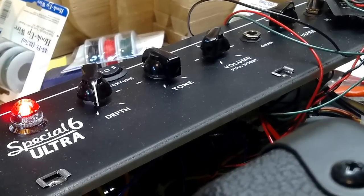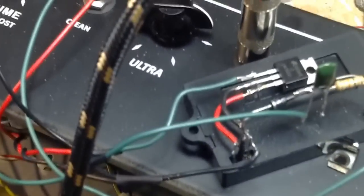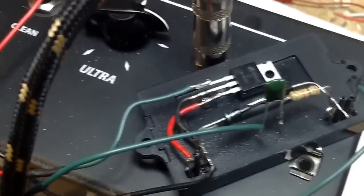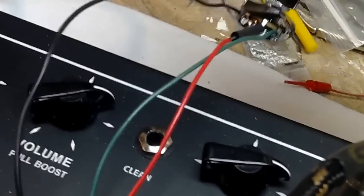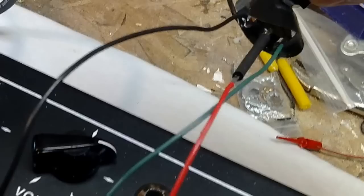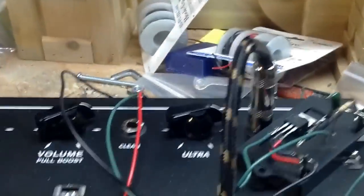Anyhow, very nice — really pleased with it. I'll have to try and get it into the amp; I think it's well worth it. That device is $15 for the brick — that's the older one, there's a newer one with a different pin arrangement. A couple bucks worth of components and then just wiring it in right. Here's the pot — you can kind of see this red wire with the 33k connected to it, but that's essentially it. I think it works really well.